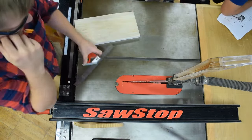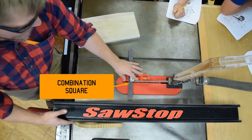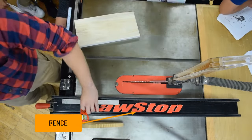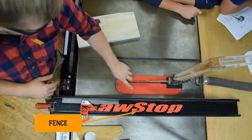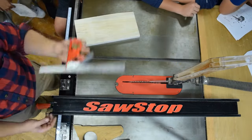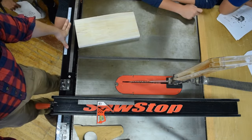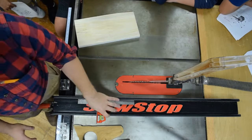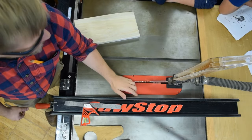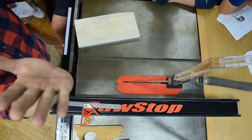From the outside of the blade it should be 4 inches. I can put my miter gauge against the fence and lightly tap it until it makes contact. You can also do this with a tape measure, measuring from the fence to the inside of the blade. If a combination square is not available, use the tape measure. Don't use the tape measure built into the saw, because not every saw has that — I want you to hone the skill of measuring from the blade tooth to the fence, since you're measuring the tooth, not the blade itself.